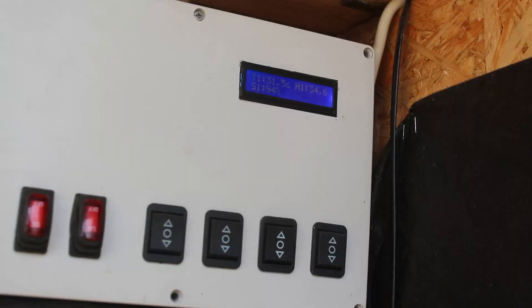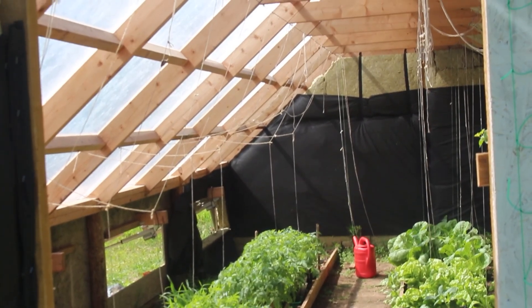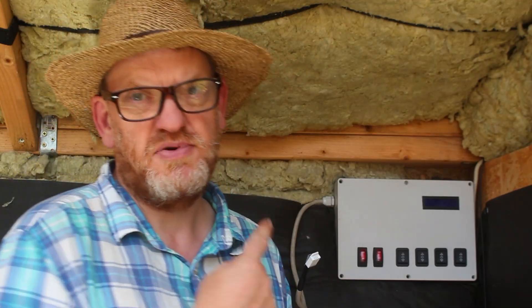In this smart world that we live in, we want to look at our phones or devices and know what's going on. We want to be in control of everything, when actually we've designed machines to keep control. And that's the case here. This box of tricks will completely look after the greenhouse all by itself; it doesn't need any intervention by myself. But 50% of the deal really with smart devices is that you can see the data, store the data, and analyse it later on. So what I'd done in the program routine is I had told it to insist that it connected to the Wi-Fi before it went through any of the function routines. So if it couldn't connect to the Wi-Fi, it wouldn't continue to control the greenhouse.